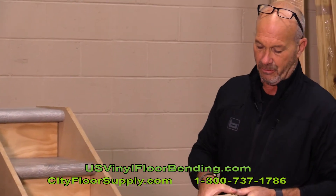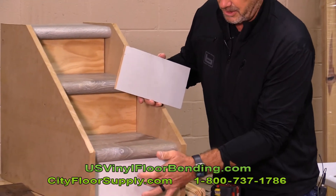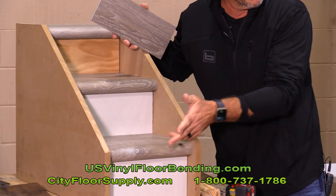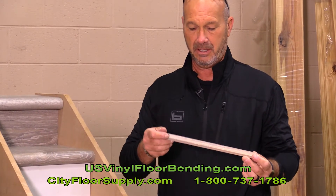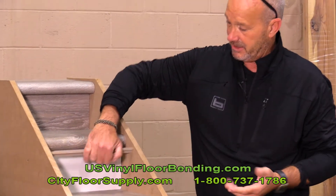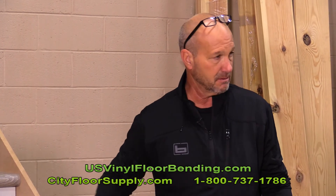Tread number two — glue it up, put tread number three on. We do have these risers numbered. What we offer is a lot of homeowners like to do pre-primed risers now, or you can also use the material itself — we did both just to show what it looks like. After you get your treads glued in, you can put your risers in. Pre-cut riser goes in pretty easily. If you have a little gap here and there, you can caulk it and make it look good. There is also a Scotia molding you can stain that is a nice look — it goes underneath the bullnose. You can dress it up with that, or you don't have to, but it does have a good look. You could even use shoe molding, but I think the Scotia is a little nicer — it has a little reveal on it.